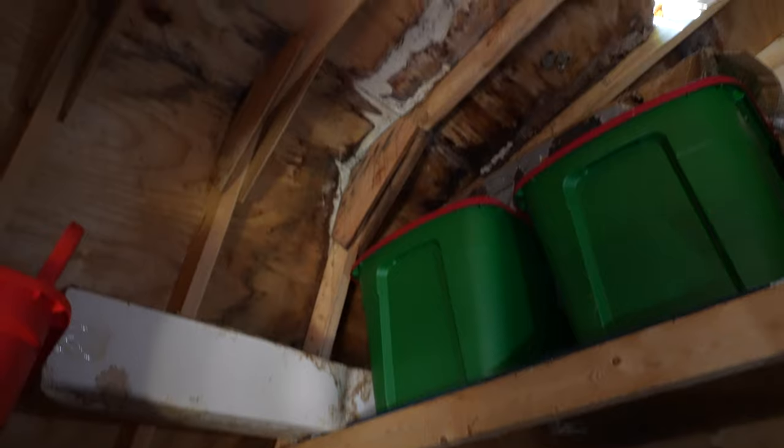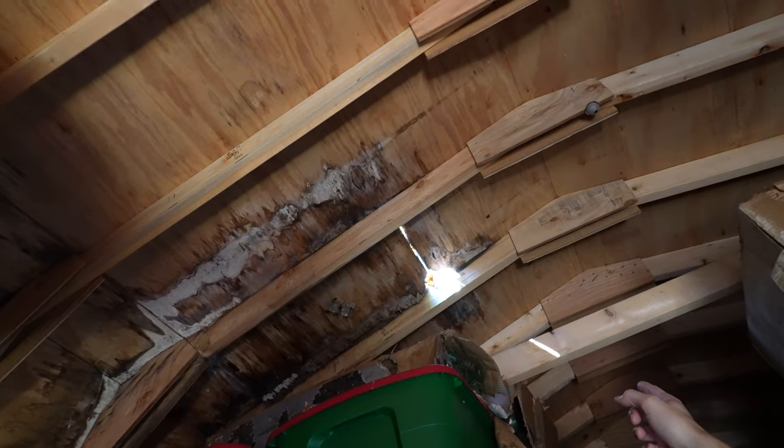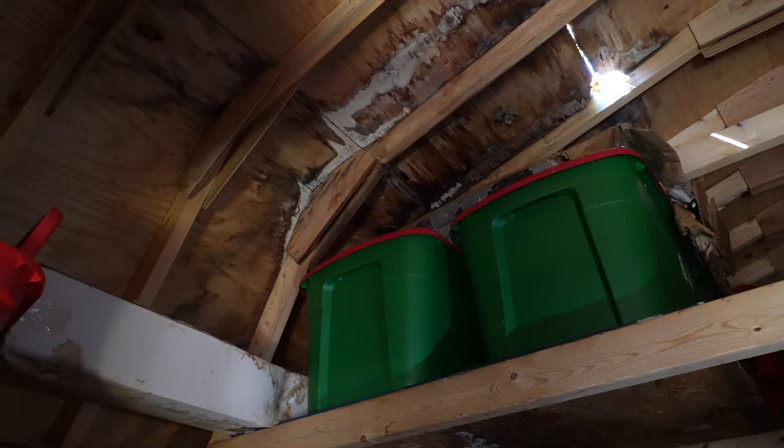We should be cutting out to this joist here. So 1, 2, 3, those look like about 12 inch. So 4 foot sheet. And we'll sister 2x4 in each of them, put the new plywood up there. And then the same thing. Those three. And I'm assuming 3 in the other direction too.